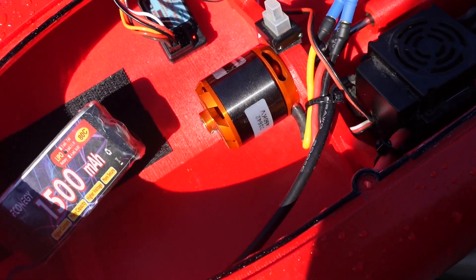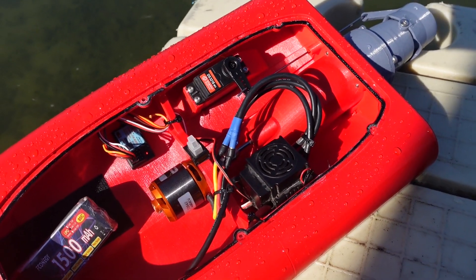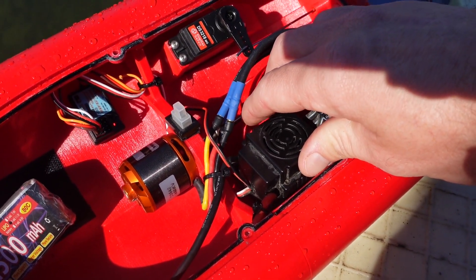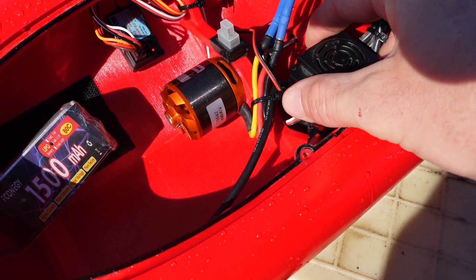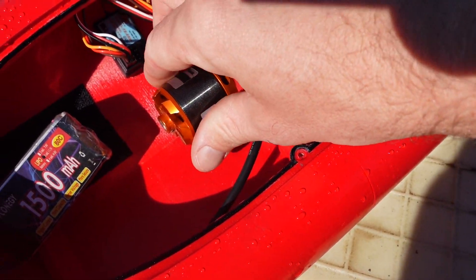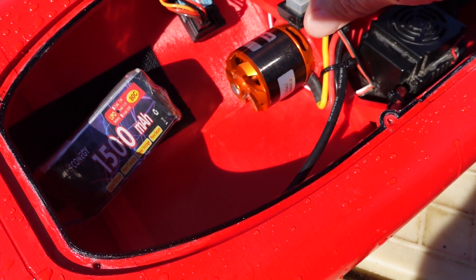There is not a drop of water inside there — that's awesome. Looks like my waterproofing worked wonderfully. I am noticing the speed controller fan is not engaging, which is not great — it's warm but not ridiculously hot. The motor itself is pretty hot, so I think we'll turn it off and give it a moment to rest.